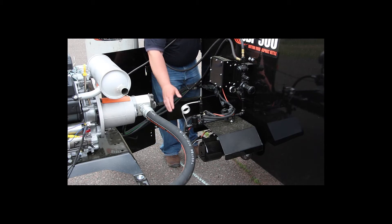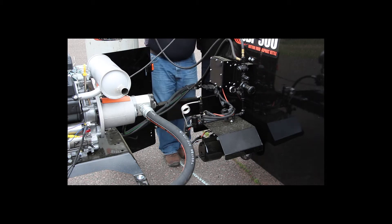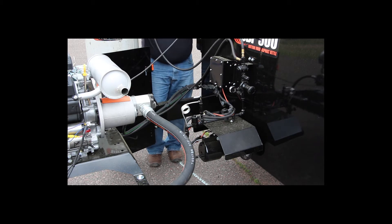Now we're going to talk about the LP system. You've actually got a pilot light and a main burner. The pilot light is the smaller burner. The pilot light has a spark ignition and a flame sensor in it — it senses if there's flame. If it doesn't sense flame once it tries to light, it's going to try to relight. If it doesn't relight the second time then it's going to go into a lockout mode. If it goes into lockout you have to turn the power off and turn it back on to cycle it. A couple reasons why it could go into lockout: no fuel, blows out, or you've got a plugged orifice — those could all potentially cause a problem.